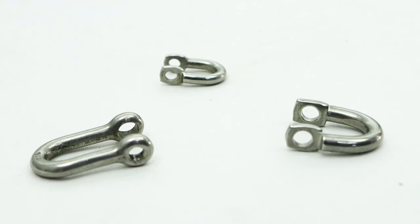On our muzzles, we have a square-edged pocket for these shackles. You'll see here there's a shackle on the left — that's a conventional off-the-shelf shackle that has round lobes to it, whereas ours are square. That's how we maintain the shackle in its orientation.